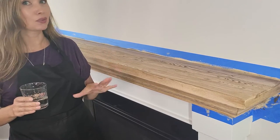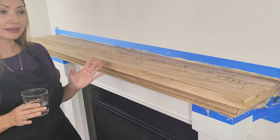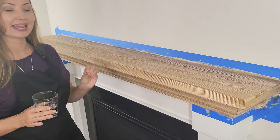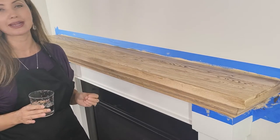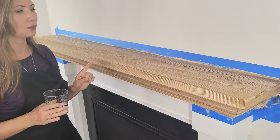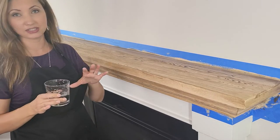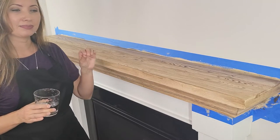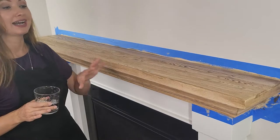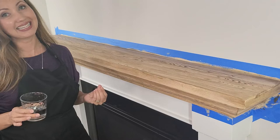If I like it, we're done and I could put a top coat on. But what's nice about the wooden primer and the wooden stain products is they have top coat built in — they're actually durable enough for exterior projects. So I may put a top coat on when I'm done just to give it a nice sheen. But if I want to keep that really lovely wood finish feel, I don't even have to put the top coat on — it's totally up to you.